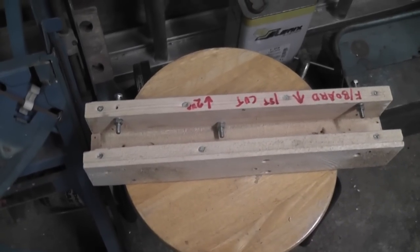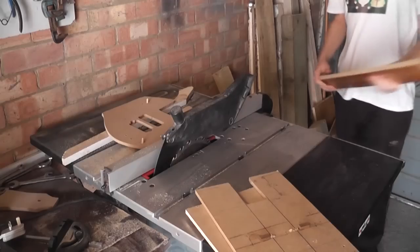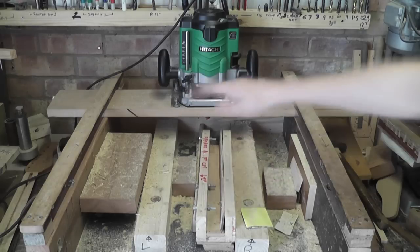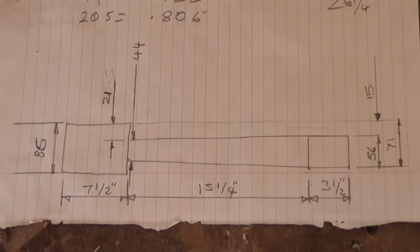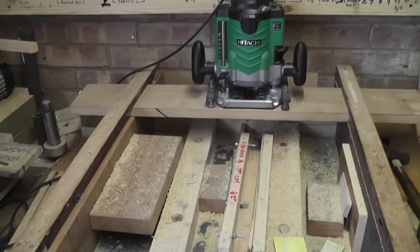This is a triangle jig which tapers the side of the neck. What I've done is take a piece of softwood about three quarters of an inch thick. Because my table saw is far too inaccurate, I've used my router table to route off all of the sides flat in accordance with this diagram. The headstock is 85mm, the nut is 44mm, and at the neck pocket it's 56 millimetres wide. To get the taper between the nut and the neck pocket, I've got this jig here — just a triangle box — so that I can route the taper onto the neck.